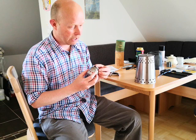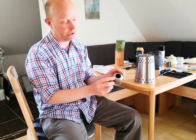And once again, a bit of physics comes in handy here, because anyone who studies physics will know about Bernoulli's theorem, and that when you make things smaller, it's a bit counterintuitive. Instead of things flowing more slowly, they flow more quickly because it's being squashed, so the air actually comes up through this smaller hole. So I created a little reducer there. It's just from the bottom of a can. It just means it's a bit smaller hole, and it increases the outflow, and it helps with the draw, so it's drawing a bit better. It will work without it, but it also depends on the fuel.